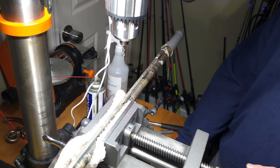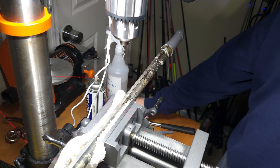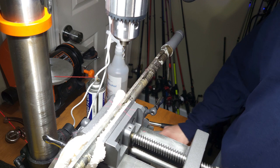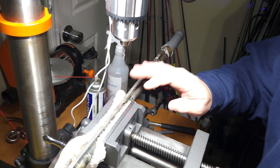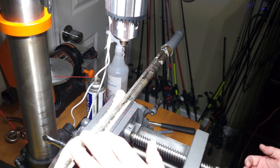It's a removable one. So once it sets up, if you want to take it out and change it, put a different bead on it or whatever, just got to put a wrench on it and turn it. It'll come right loose. But that's how to install a sight bead on a shotgun on a vent rib. Procedure is the same if you've got just a plain barrel and don't have a rib.